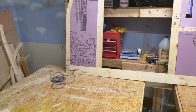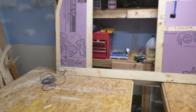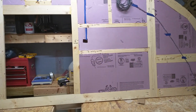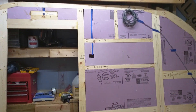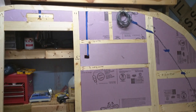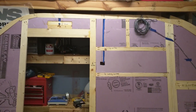Both the navigational lights — that's the ones that run the running lights and the brake lights and that kind of stuff — and also if you have any low voltage or high voltage lighting on the inside of the trailer so that you have lights while you're camping. We are not going to have any high voltage lighting. We will have some high voltage receptacles, some plugs later on, but we just have some 12-volt lights.